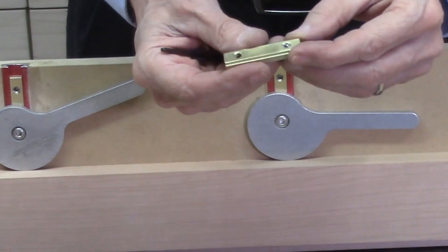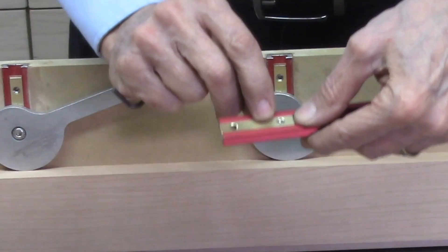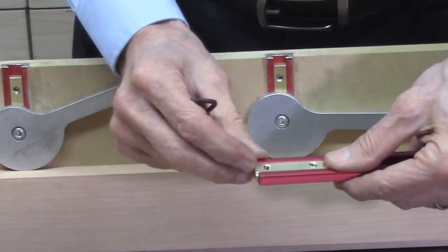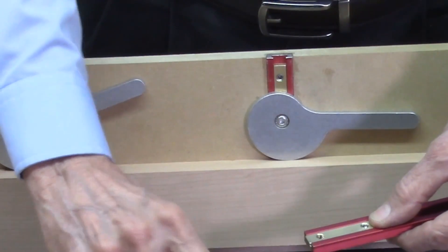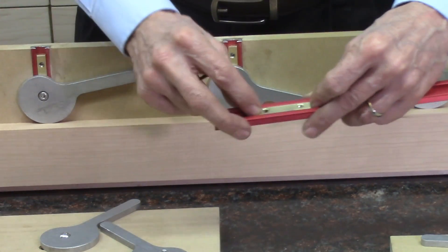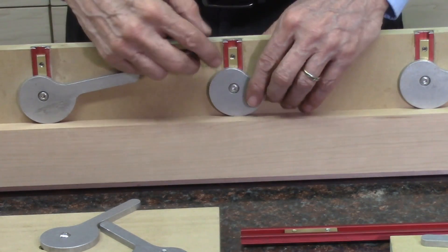The new system uses a two-inch long brass key that slides into a T-channel. On one end of this brass key is a set screw, which enables the brass key to be locked in place in the channel. On the other end is another tapped hole that the offset cam clamps into. I can adjust this to any position along the channel to get the correct height for clamping. This is one of my initial concepts — a long sacrificial fence.